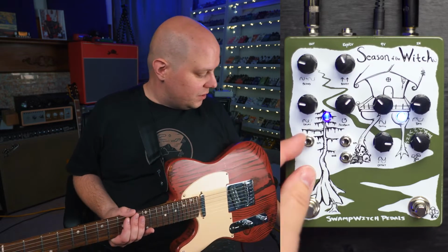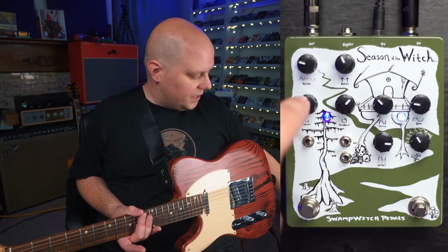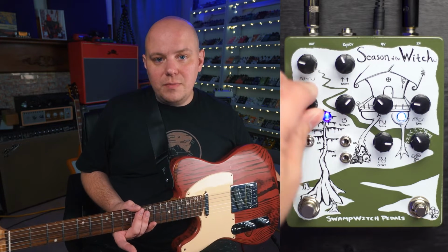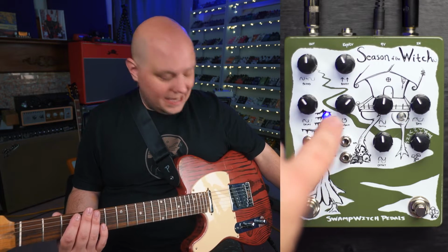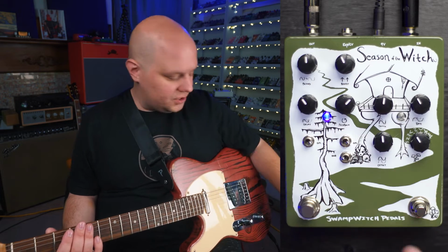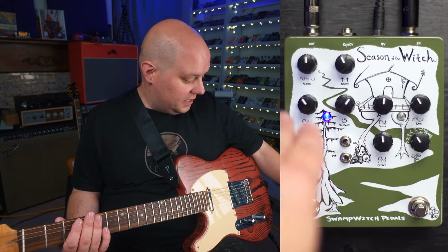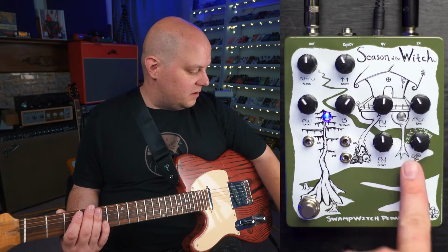When we turn either toggle on, that relieves the delay control of working. So right now, since the left toggle of the delay is on, I'm not going to be able to control my delay time. And same with the feedback. Right now, since the toggle is in the left position, I can control the feedback with this knob, but once I turn it over into the right position, in the on position, the feedback control no longer works, and we now control both, in this specific instance, the delay and the feedback with this LFO section right here.